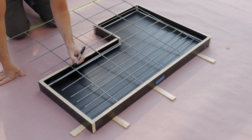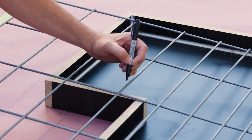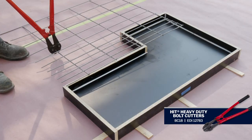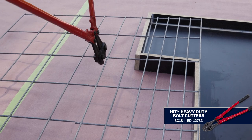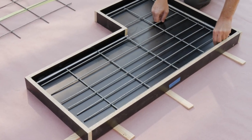The countertops will need wire or rebar to reinforce the concrete. We chose to use galvanized metal wire fencing. To cut it, use bolt cutters or a grinder with a cutoff wheel. Test fit the metal fencing sections before you pour.